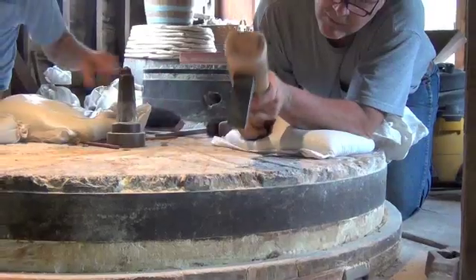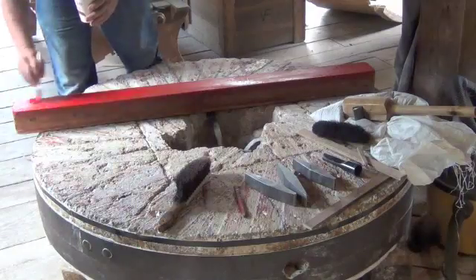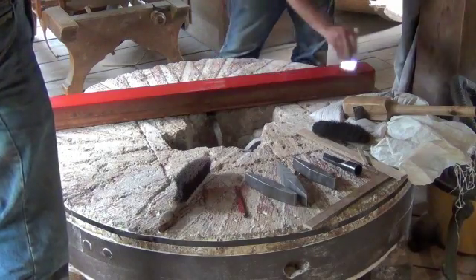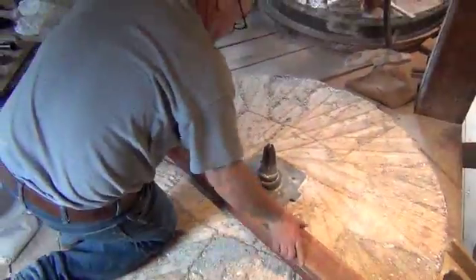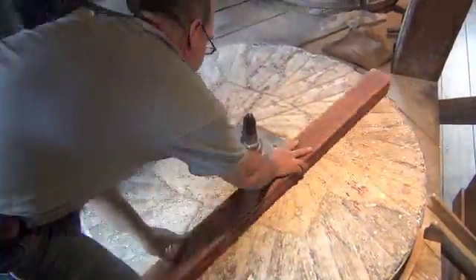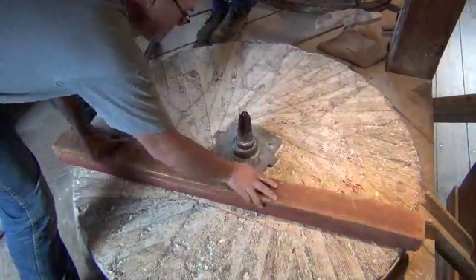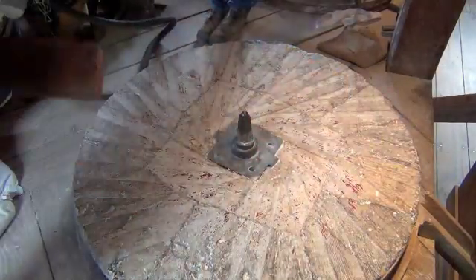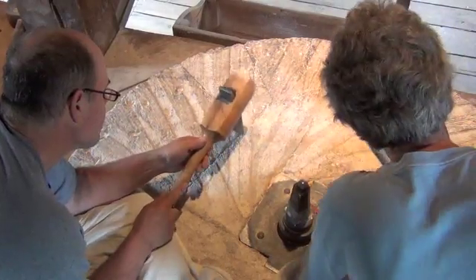One aspect is using something called a paint staff. The paint staff is coated with an iron oxide pigment mixed with water, and it's then dragged across the stone. The purpose behind that is that it gives the millwright knowledge of what areas of the stone are out of level — it will trace across areas that are too high — so that allows them to go piece by piece and lower those sections so that the stone is perfectly flat.